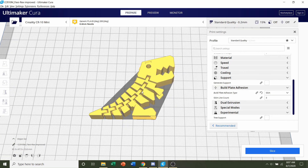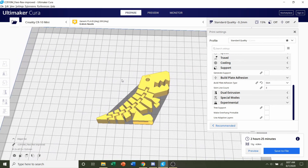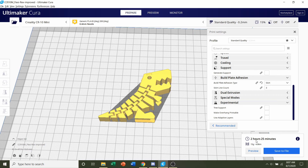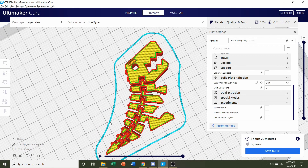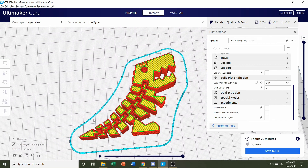Other than that, you're more than set. Once you're ready, click on the blue Slice button and give it a few seconds to slice. Once it's finished slicing, you will see a time estimate of roughly 2 hours and 25 minutes — though that will depend on the printer you're using and the settings you used — as well as an estimated filament usage of 15 grams. You should always preview the print and take a look to see if anything weird or funky is going on. Everything looks perfectly normal, so all you have to do now is save the file and send it over to your printer.